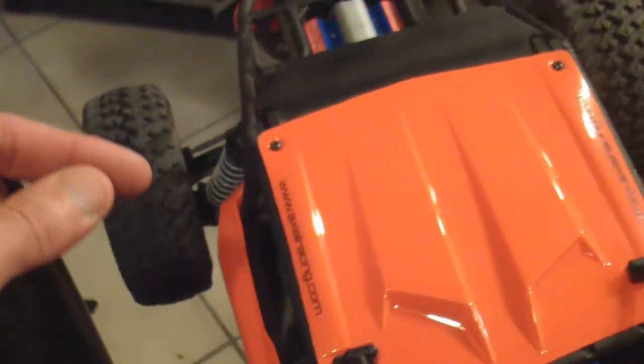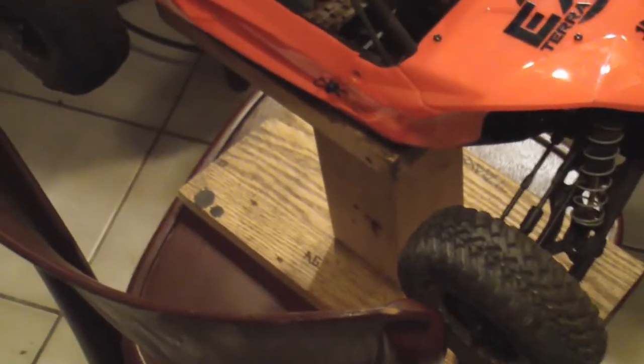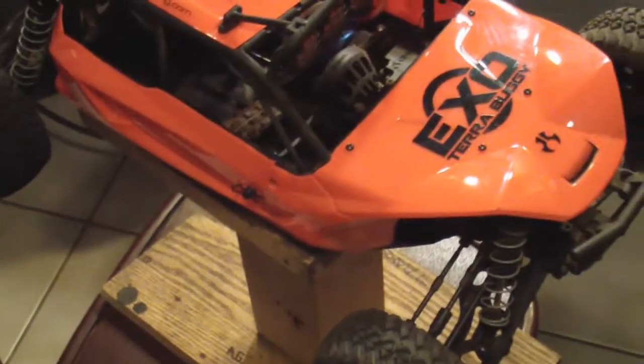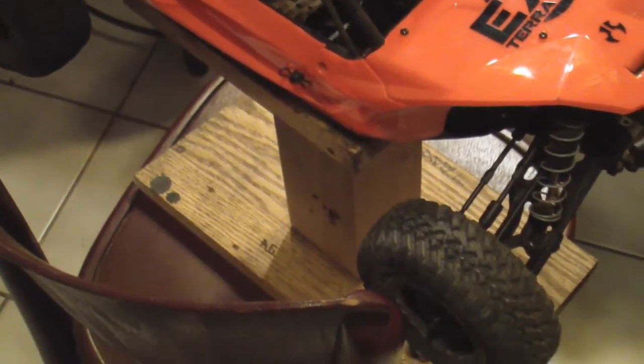The rear pins are sliding out maybe, what would I say? I say about 3-4 millimeters. They're not going anywhere because they are captured, but the groove is 3-4 times wider than the grub screw. So the pin can slide 2-3 millimeters left or right. Although, there's a groove inside the pin. It's a captured pin, but it still allows it to slide back and forth.